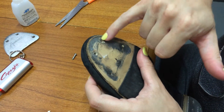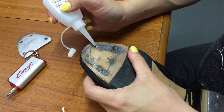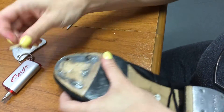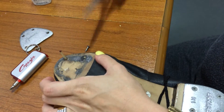Make sure the area is cleaned out and there's no sawdust or residue left in the hole. Place a tiny bit of super glue into the hole and, using your matchstick, place the matchstick into the hole firmly and cut to size.